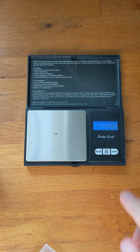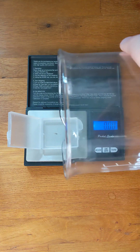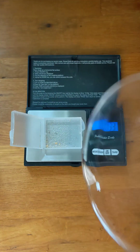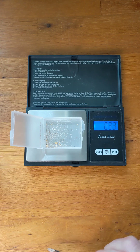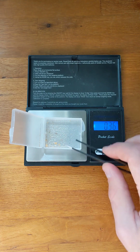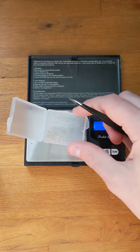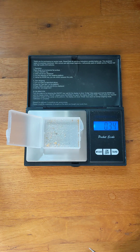So let's weigh it up. I dried it and weighed it — I've got a little pot here, tare that out. Now I'm used to pouring powdered gold, so when this came out they're all tiny little ball bearings basically. They all came flying out and jumped straight out all over the desk, so I had to go around and use my tweezers to pick all those tiny little beads up. The scales are showing 0.3 thereabouts. There's a bit of undissolved borax which adds to the weight slightly, but probably not too much. Once I picked everything up and put it all in the pot, I think weight wise we got to 0.33 from memory.